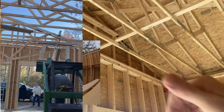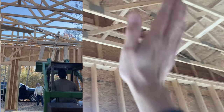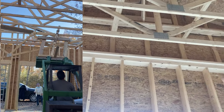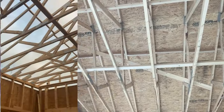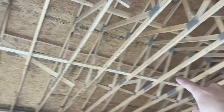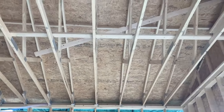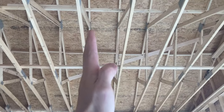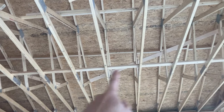When I got to the end, I had to put the last three or four trusses up at once because I needed that space for the flipping. I put them all up and leaned them against the last gable, which I put in at that point, then carefully slid the last three into place. The whole time you're putting in spacer blocks to hold them up against the last gable. Once all the trusses are in place, you start putting in all the cross braces, which are really important — they give the roof its structure. Without them, under snow load these could start side-wobbling and that just cascades into failure.